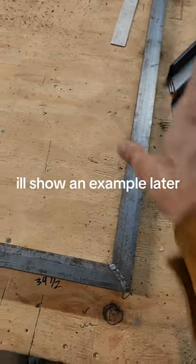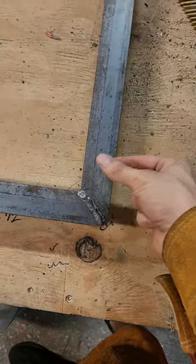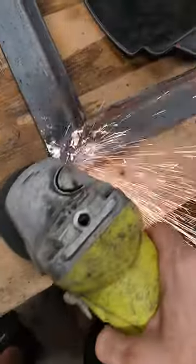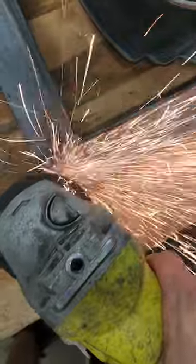It looks ugly because like I said, MIG no gas. This side is gonna be pressed into the inside of the container going outwards, so we're gonna be welding this to the actual container. I've got to fill all these welds up here and be careful not to make them too big, otherwise we're gonna have a little gap and the window could be crooked if it's uneven all the way around. So we want the insides right here super flat — I'll probably have to grind that — but the tops here don't matter.